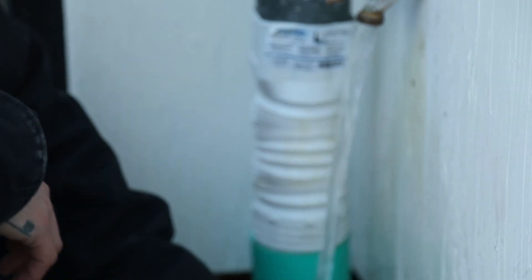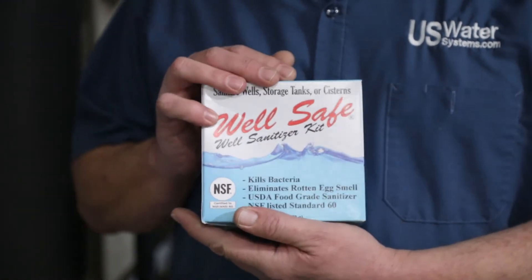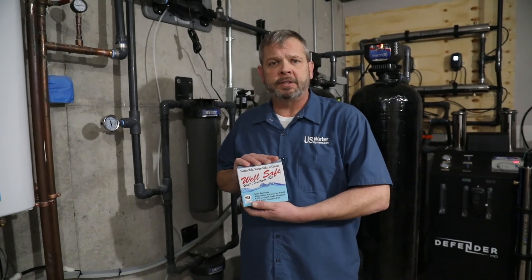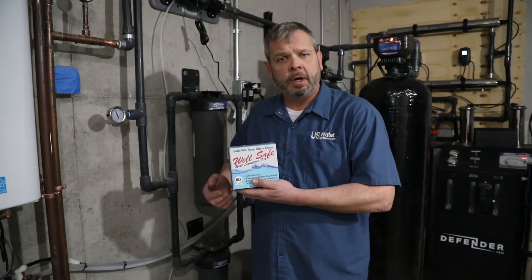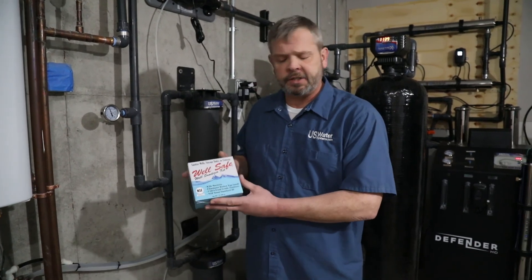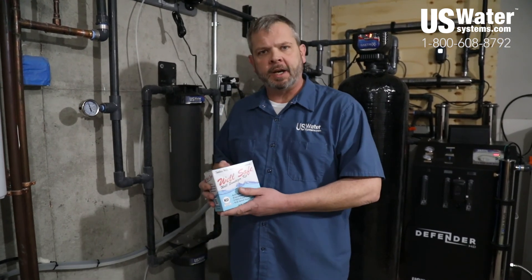That should be your target. So we're finished installing and starting up the system — we're basically ready to move on and start up the rest of the equipment. This was, in a nutshell, how you're going to install and start up the infusion system. Don't forget to chlorinate your well prior. This chlorination kit comes with the infusion system — it's crucial to the success of this to make sure you've killed everything in your plumbing system before starting up. There are instructions inside that tell you how to chlorinate your well based on the size, depth, and casing size. Thanks.